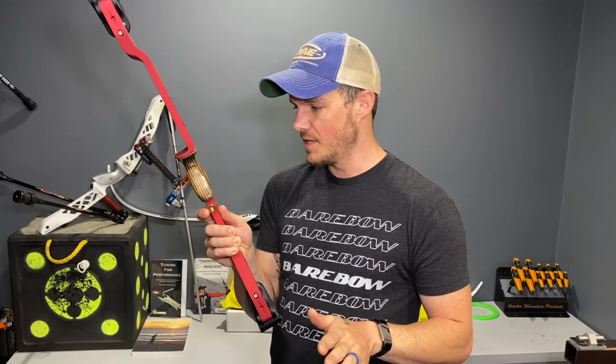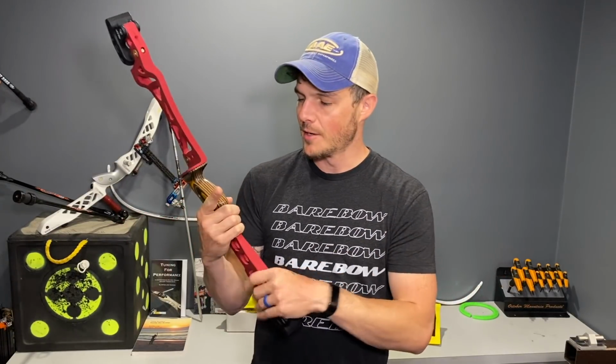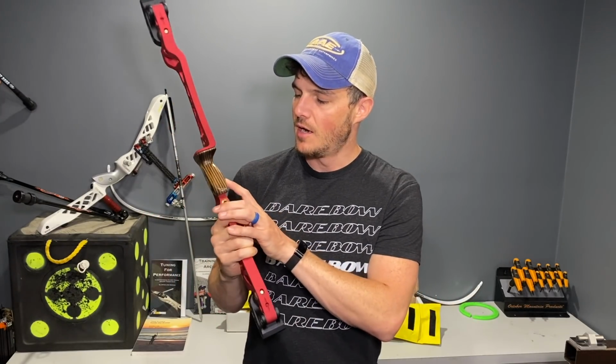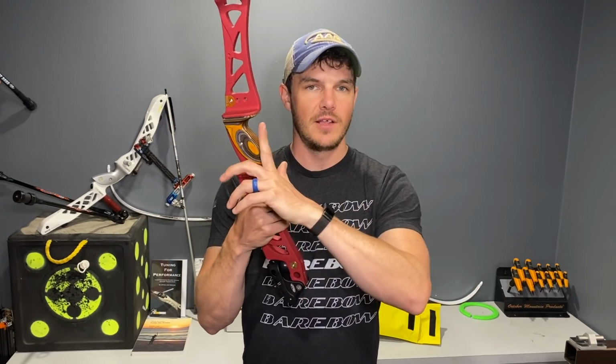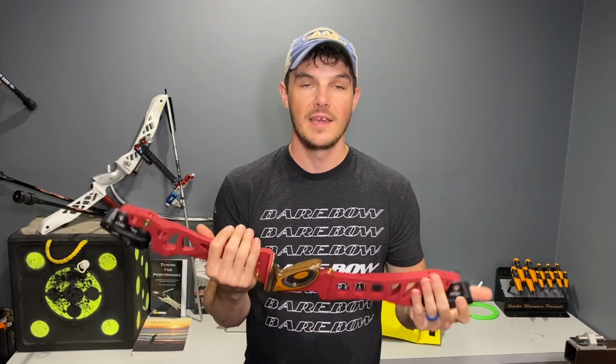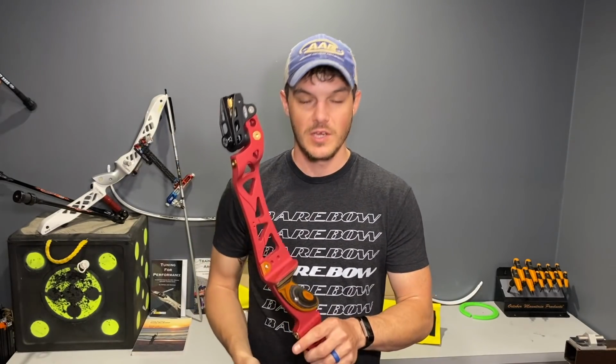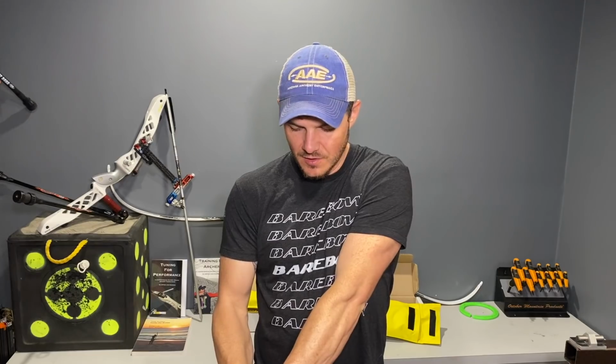It's wood, which is great because you have the ability to shape the grip in all directions in many ways without having to fill a cavity pocket behind it. In many of the plastic grips out there, the section in the center where it's elevated and raised has a pocket in it, so they don't have to put so much plastic material into the injection mold itself, to save costs on material. But what that means is you can't cut it down very low and flat without opening up that cavity, so you have to worry about filling it or getting yourself a wood grip and then not having that issue. So it's nice to see that they made it out of wood, and we can do anything we want to this grip without any sort of negatives, basically.